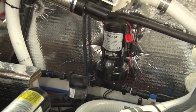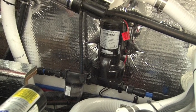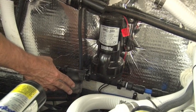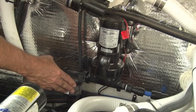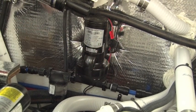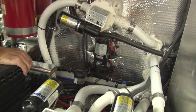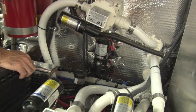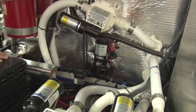This component right here is the boat's fresh water pump. Most of them are a rotary style pump with a diaphragm and a series of check valves. One of the things you need to look for in maintenance is this filter right here. As you get particulates from the water tank, they'll plug up this filter and water flow will decrease. The fresh water system hooked to the dock does not go through this filter. This particular pump is an on-demand pump — when you open more than one spigot, it'll actually increase its speed to give you greater flow. It's done electronically. The fuse is there to protect the pump; a regular breaker won't protect it because it takes too long to open the circuit. The vendor puts a fuse right there — it's normally a 20 amp fuse.